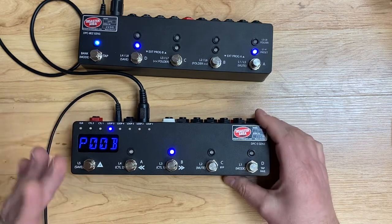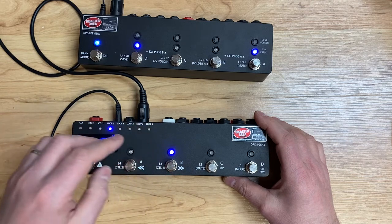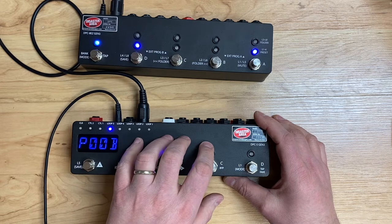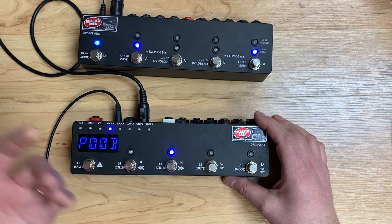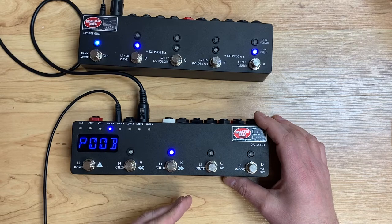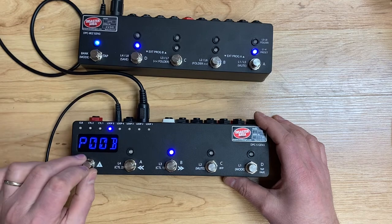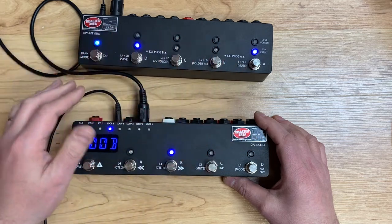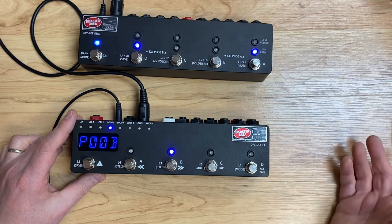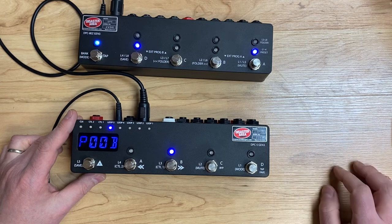That's it in a nutshell. The basics are: make sure you configure both units correctly. If the auto-configuration doesn't work, or if the ADZ responds in both the A and P modes, update the firmware on the DPC-5 — version 1.04F works, and I'll include it in the description. Once everything's configured, follow the steps in this video: make your changes on each unit, save on the ADZ first, then pick your destination and save on the DPC-5. It'll send a save command over MIDI, the ADZ will follow along, and you'll get a visual LED indication that everything is saved. If you've got any questions, send an email to support at DisasterAreaDesigns.com. Thanks for watching.